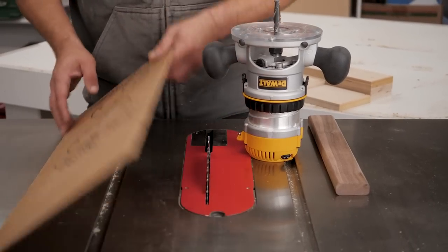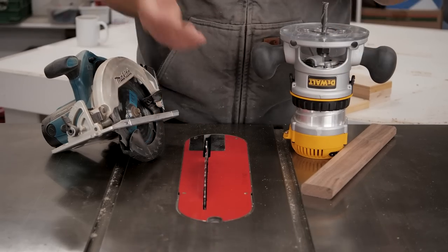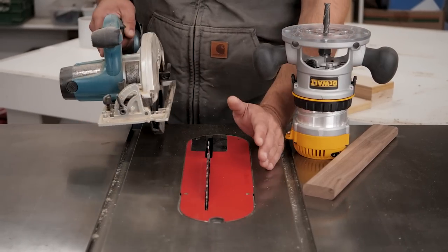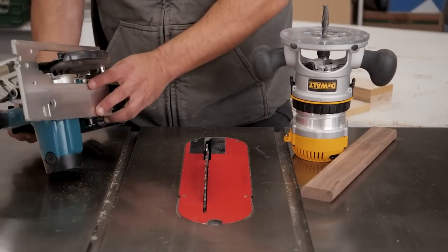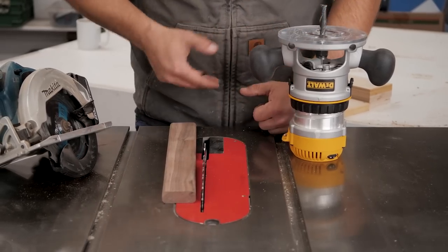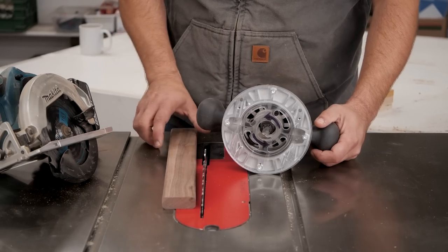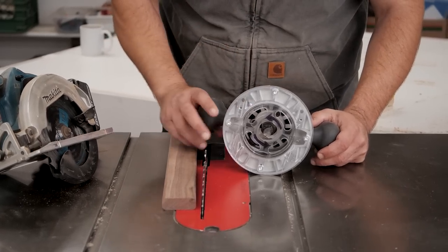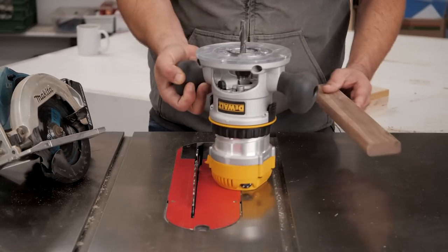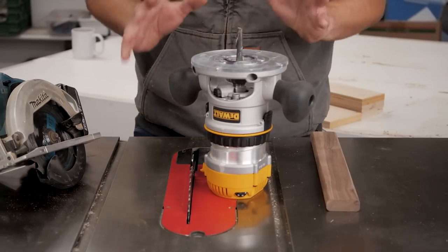This is the same as a table saw versus a skill saw. When you are at your table saw, the blade is upside down and you push your work piece into the teeth. When using a skill saw, it is right side up and you push your tool into the work piece. You always want to be cutting against the teeth — you would never feed a work piece into a table saw from the wrong direction; it would grab and shoot it out of your hand. Same with a router bit: always work opposite the direction it's spinning. Handheld, work on the right side of your piece and push away from yourself. On a router table, put the work piece on the left side of the bit and push it away from yourself.